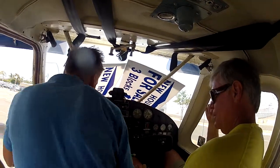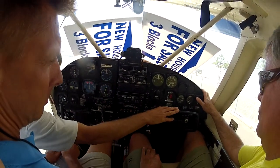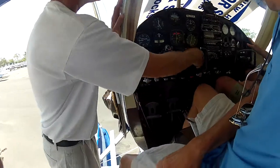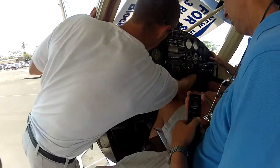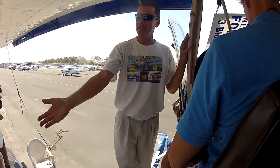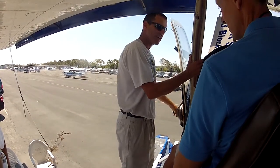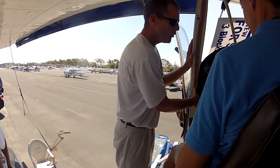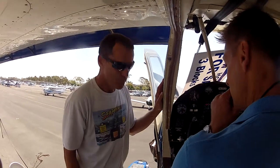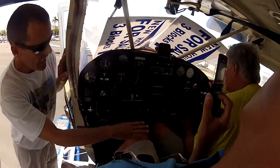The Helio is pretty much like the Cessna 185 or 206 — it's pretty simple. We have most of the circuit breakers there and all our controls over here. What I do if I'm on a deserted island is I pull out our gyros, pull out our lights, and make sure our master is off and all these are off. I've had three or four times an engine not start well and the battery went dead. In a remote area, I will pull out all the electricity — not necessary, just a safety feature.